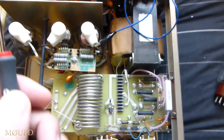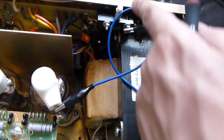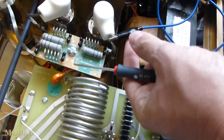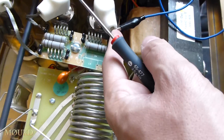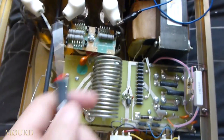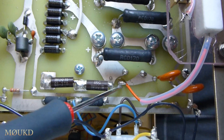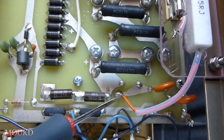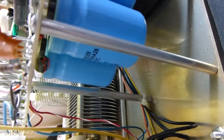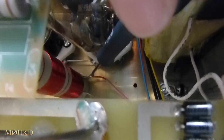Make sure the plate voltage is all the way down, give it five minutes, carefully take the lid off. Run a connection from chassis ground on there first and then on to the anode supply, just to make sure there is no voltage in it. This is the high voltage power supply output — usually this wire connects underneath the board, but I've disconnected it.